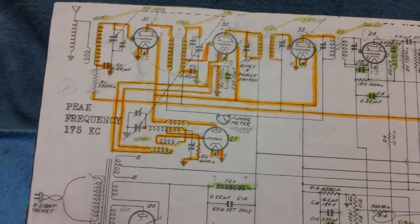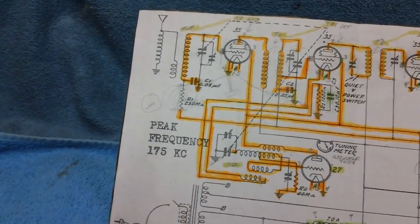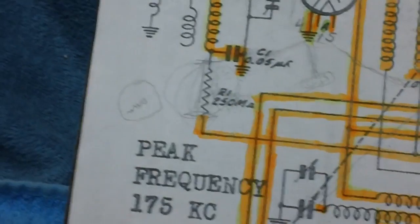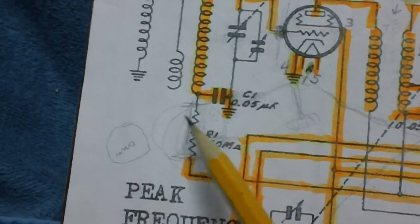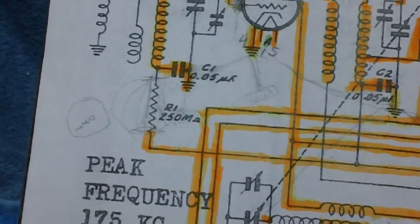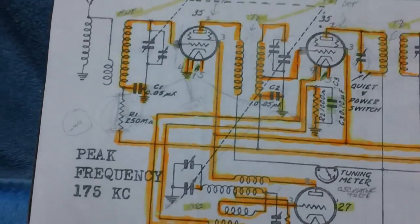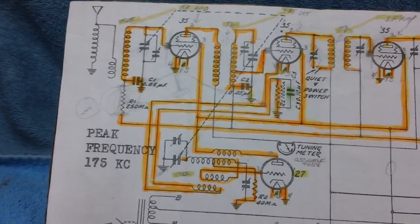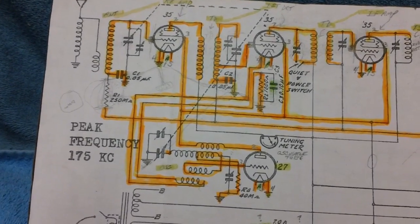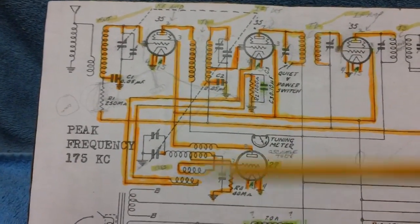Our good subscriber Gordon Cole watched me measure the resistance of this 250,000 ohm resistor, and it read 563,000 ohms - way out of tolerance. Gordon suggested that if you isolate this resistor from the circuit by lifting one end, maybe it'll read lower. I covered this exact same scenario once before in a video where we would break a radio and see what happens as a result. Let's take a look at this in the same kind of light.